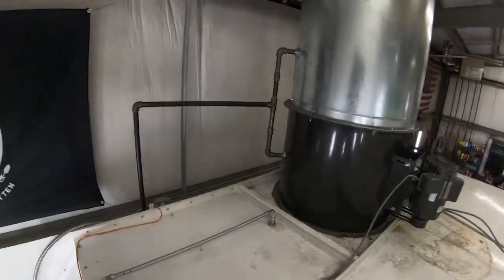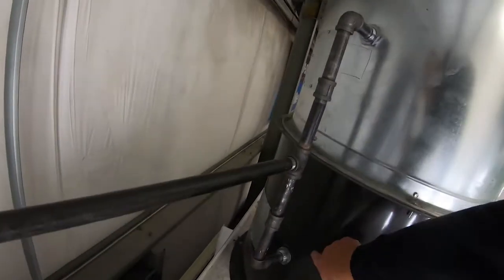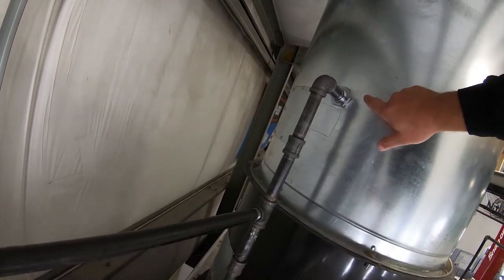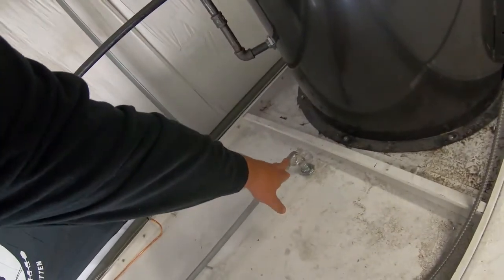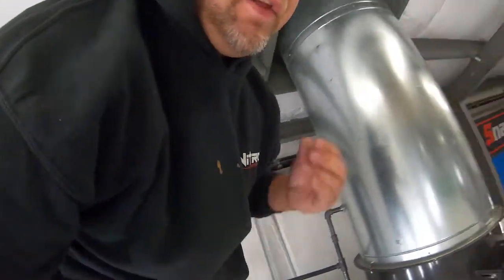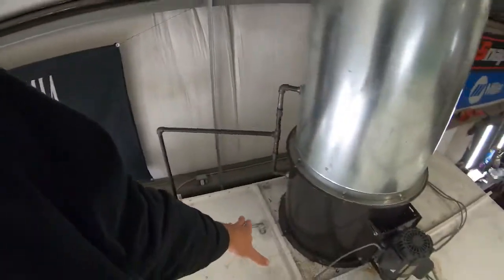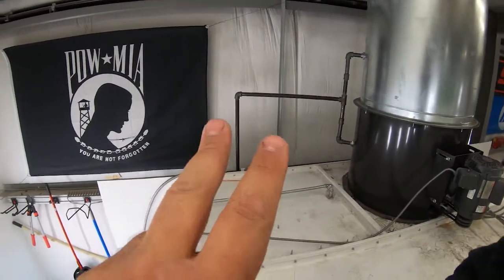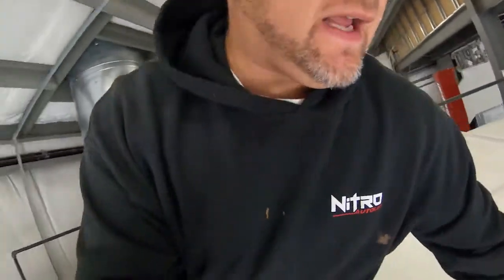You can see there's 2 more nozzles inside there. Now there's one below your fan and one above your fan. There's another cable in there that actually is an automatic trap. It's got a little fusible link. Now when it gets to a certain temperature, it breaks and that cable snaps tight. I'll show you guys when I get in there. So I'm gonna crawl down. Now those two nozzles are on a completely separate PCI 17 tank down below on the back side.